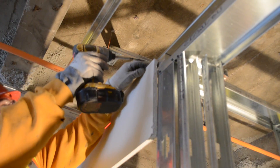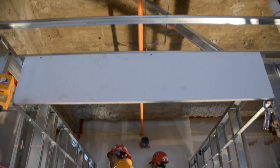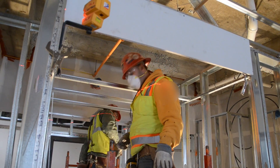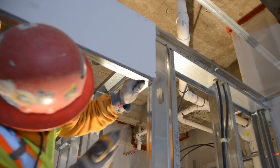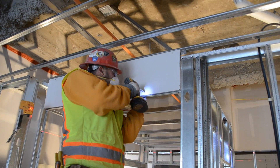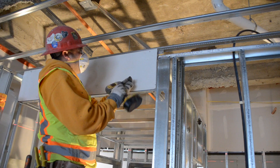Screw attach your drywall to the inverted piece of CAM utility angle and let it hang wild. Fill in the entry hallway with short span and no wires to structure since it's narrower than 7 foot 1 inch. Since half of a short span tee is 5/8 of an inch, it nests up alongside your wild hanging 5/8 inch drywall. Just screw the bottom edge of your drywall drop by placing your screws through the bulb of the lower short span tee. You'll need one more short span tee at the upper 90 degree transition point.